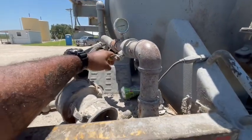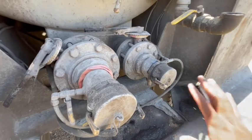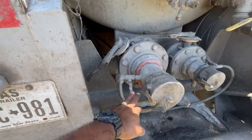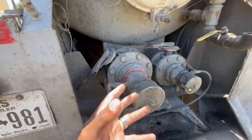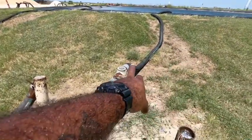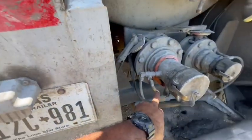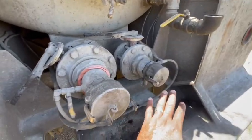If we have this valve open you can hear the suction releasing. Another way to confirm it's on suction — these air valves here come off the airbag. You open this up and if your line is clogged or loaded with mud, here you have a check valve so you don't have that problem. When you're blowing pressure back through a line, that's when you want to use this air valve. Sometimes these valves leak.